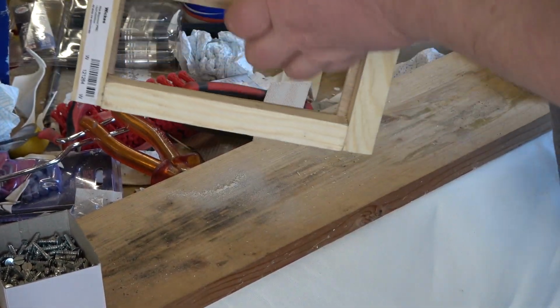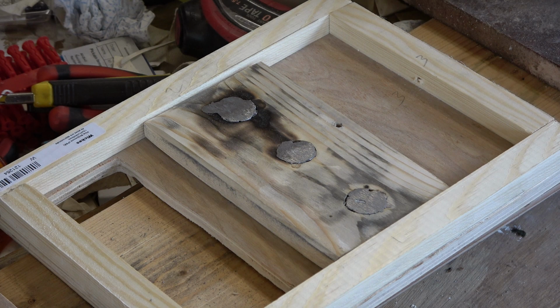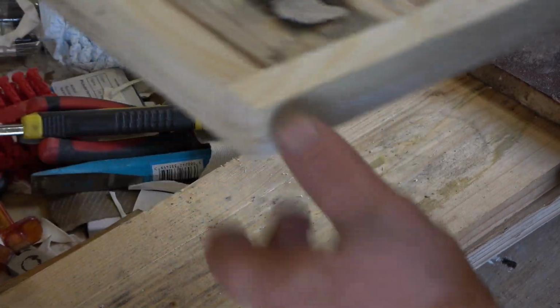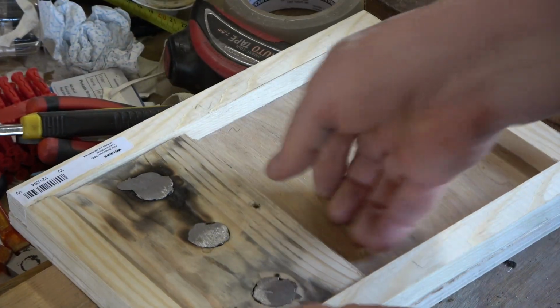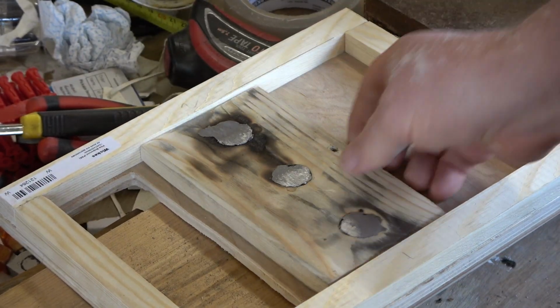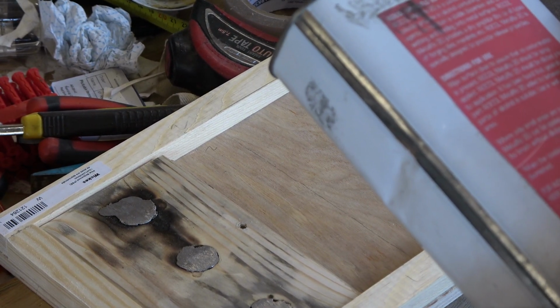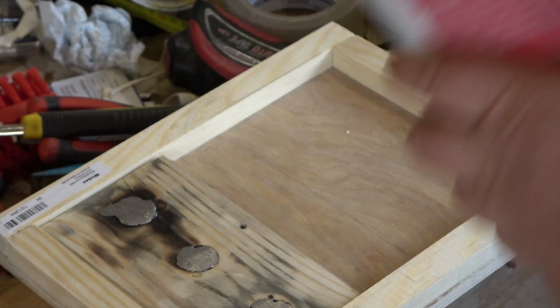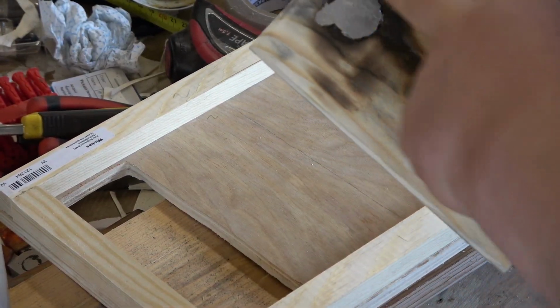Right, so with a bit of leftover floorboard, I've cut this, we've taken the groove out of there, still got the tongue on there, well just. I've planed that side because it was too thick by about 4 millimetres. That's planed, sanded, that should fit in there without any obstruction. So the idea now is that that can go up and down and open and close. Let's see. Especially if I get this the right way on. I think that's the right way on. Yeah, that's the right way on. So I'll just do that tightly. Good.